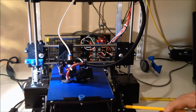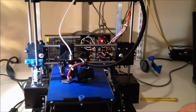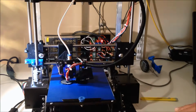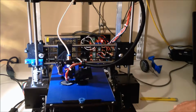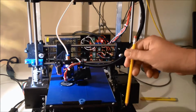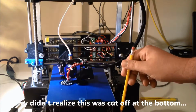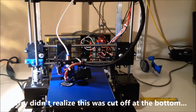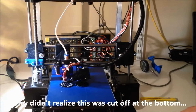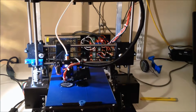The other thing we've modified is the belt holders. The belt holders that come with the TwoUp originally were simply pieces of melamine. Here we took an existing one from Thingiverse and modified it again to hold the number 6 nuts, so they're recessed, and you simply tighten them down with, I think, 3/4 inch or 1 inch number 6 screws. So again, that's worked very well. We did have an issue over time where the belt would come loose, and so far, knock on wood, so good.